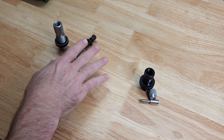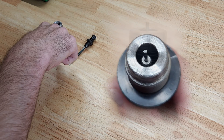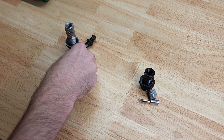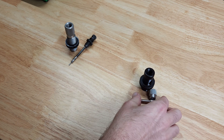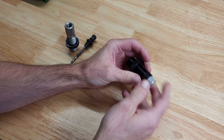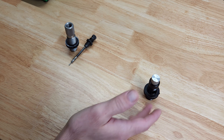I'll put a picture on screen, but with my full-length sizing die the threading is a little off and the expander ball does not sit centered in the die. So when you're reloading your brass, it's going to torque the neck slightly, which can cause run-out when pulling it back out. The mandrel, on the other hand, is free-floating — it just screws on and sits centered — so all you're doing is opening the neck back up after sizing.